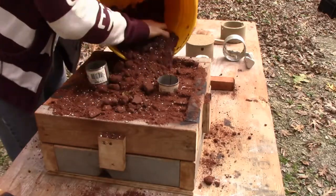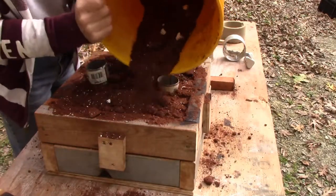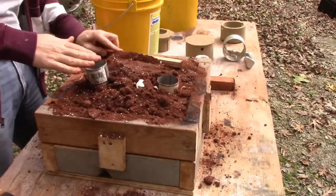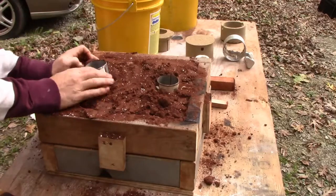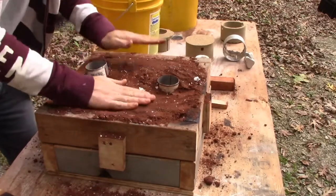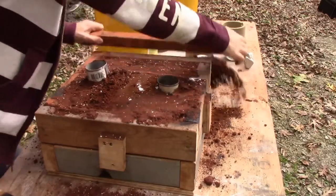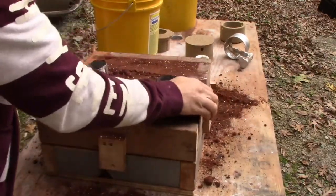As you can see, I have some cruddy Petrobond here. This is just for these fast molds that I do. And the reason why I like the Petrobond is because it packs. So, on the other side. Okay. I'm going to do something a little different here. What I'm going to do is join the two with a trough channel.